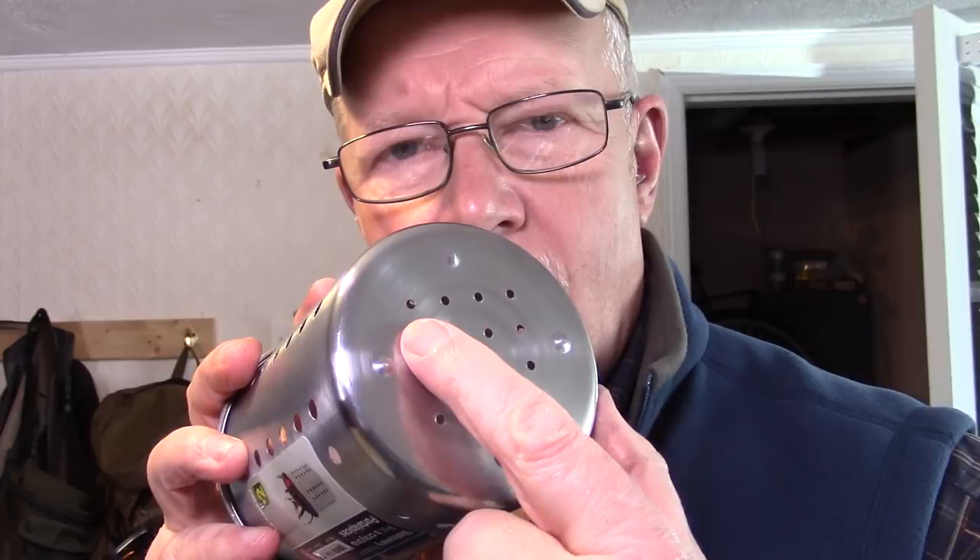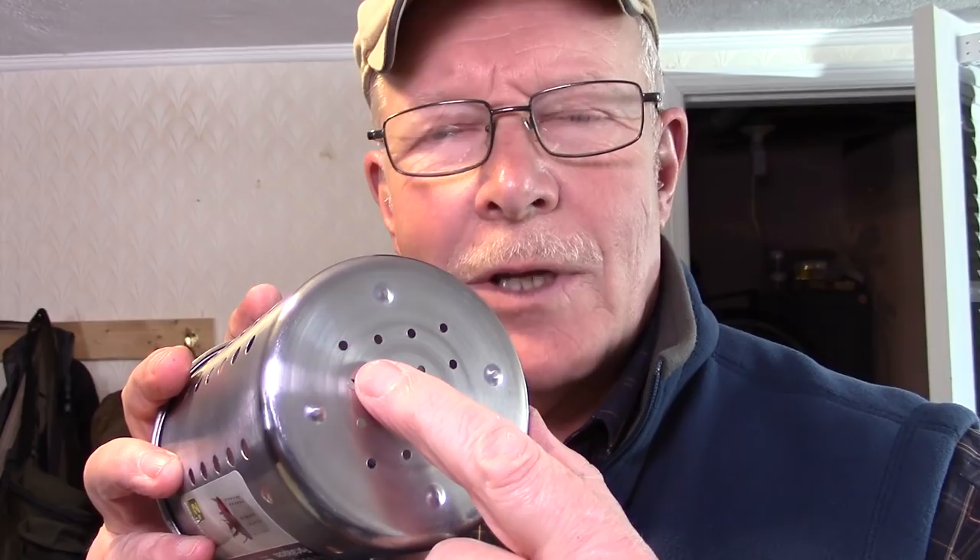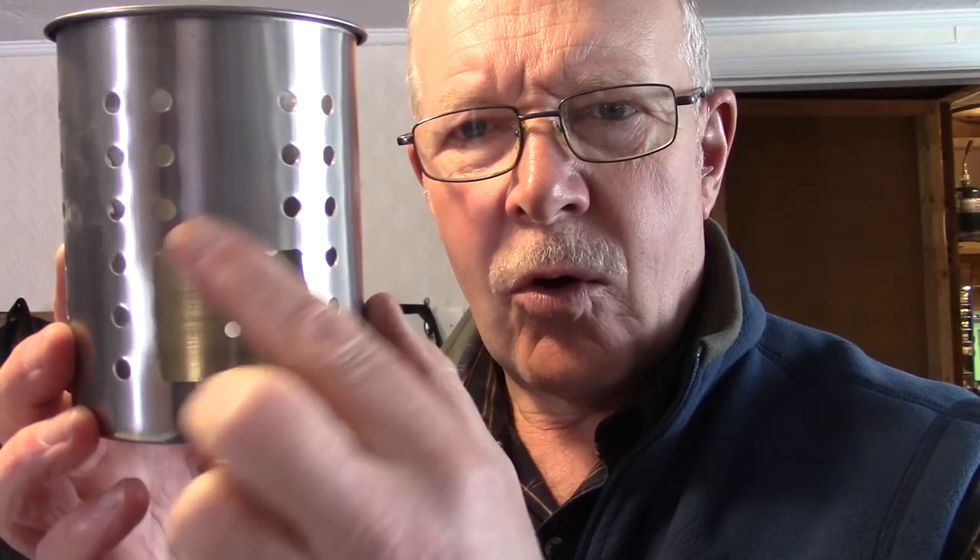To keep this video shorter than the original three-part series, I'll tell you what I'm going to do and reference you back to the original video rather than go through all the steps again. The first thing I'm going to do is make the feed hole on the side. I'll cut across — about an inch and a half square — similar to the Emberlit Fire Ant, which keeps the hole small enough so sticks don't fall out when fed from the top. I'll also open up the corner holes slightly for the number six bolts.